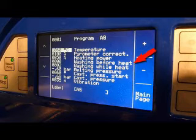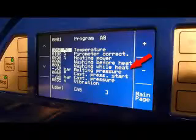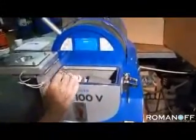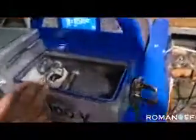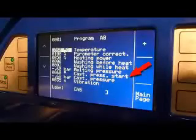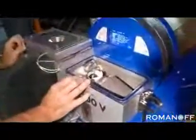A wash cycle is a combination of vacuuming and an introduction of argon gas to clean out the chamber of any gases that may be in there. The next parameter is the washing cycle while you are heating, and you can determine how many washing cycles you want to use. The next one is the melting pressure — that means the amount of vacuum that the chamber will be under during the melting. The next parameter is when the casting pressure will start, which is the point at which the casting chamber is tilted and the pressure begins.